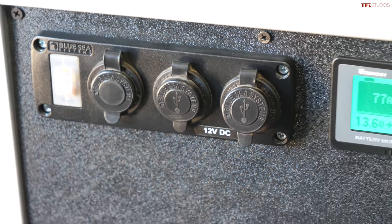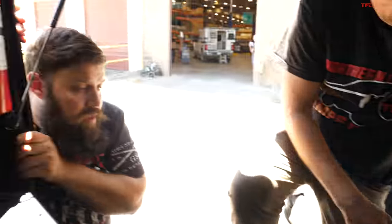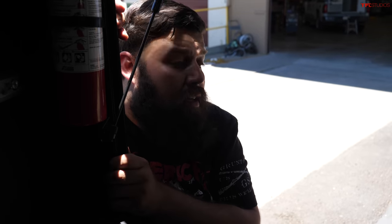The battery is also connected to the camper's power system, giving power to four roof lights and two fans. Without charging, the AGM battery will keep up with the demand of fans and lights for a good amount of time. We didn't plug the camper wiring directly into the Lightning truck — partly because the truck is so new we didn't want to open any wires, and also because the Lightning's bed outlets are 120-volt and 240-volt, while the Project M runs on 12 volts. So we used Four Wheel Campers' provided solution.